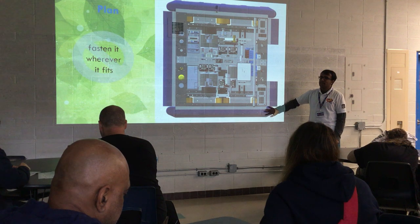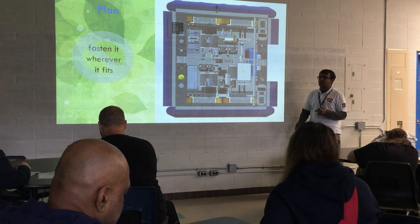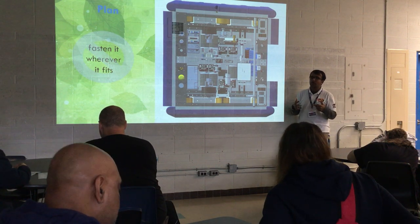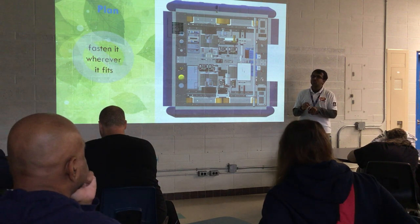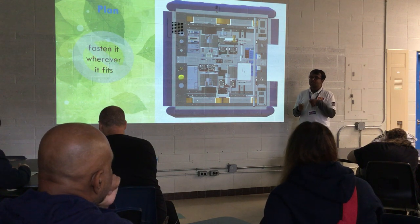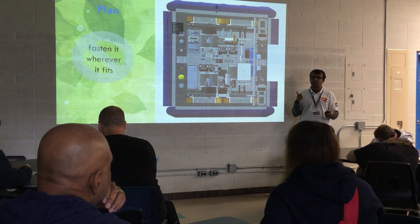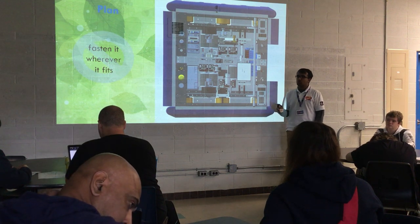It's not just about planning and setting up your electrical system once — you also need to plan for maintenance. If you have pre-made wires already attached to your motors with crimped connections, you can easily sub out motors if they burn out, or swap motor controllers.